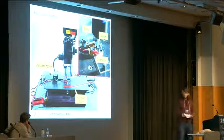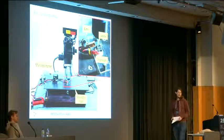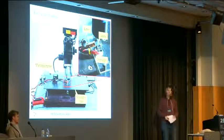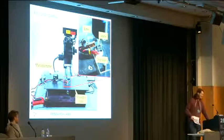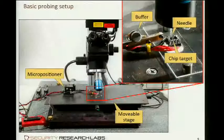The needle itself is made of tungsten. You might know tungsten is not solderable, so we have a removable connection here. You can just pick that. Oh, it's fun. Yeah, it's meant to be removable, and everything is glued in epoxy. After that, a measurement amplifier is bringing everything to TTL levels to hook up a logic analyzer.